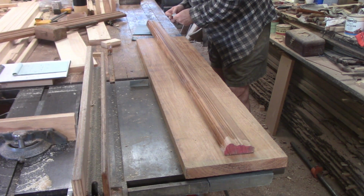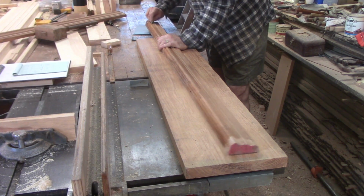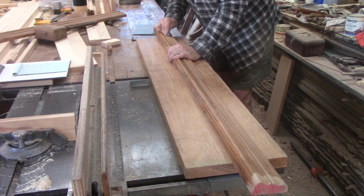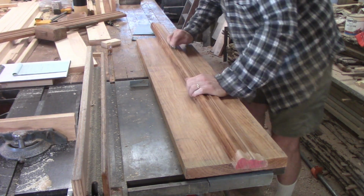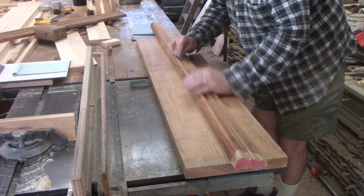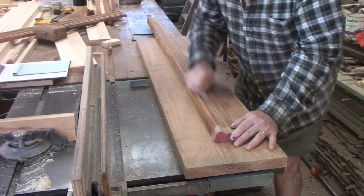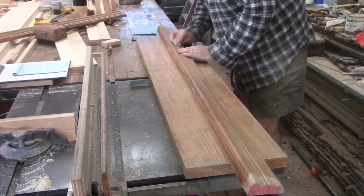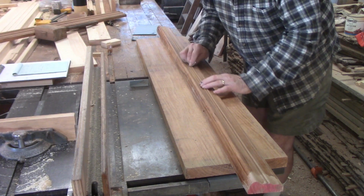So, it'll be fine. Okay, so I think I'm now going to do this hollow part right here. This won't take much longer, and then, whoa, look at that. And then I'll obviously throw another coat of shellac on it. That'll be tonight's, probably. I used some old, thickened shellac for the first coat. I think I'm going to use a lighter, fresher shellac for the second coat, something that doesn't have as much body, as they say.